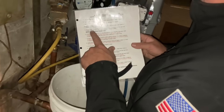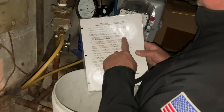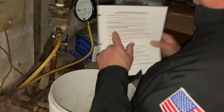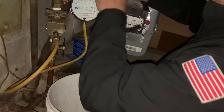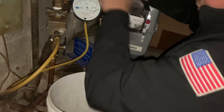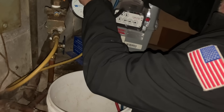We're going to bleed the high pressure hose by opening A and B on the test kit. Once we're done bleeding, we're going to close B. Remember, this is A, that's B — so we're going to open A, open B, bleed the air out, then close B.